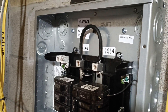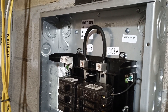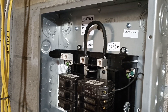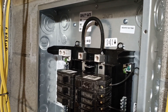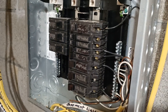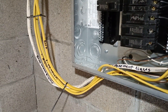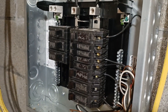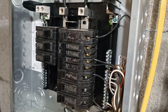This would not be a safe thing to do if you are connected to grid power, or if you ever want to use any double pole breakers — double pole breakers would require 220 volts, and having that jumper across there with 220 would not be a good thing. If you are using an inverter that produces 220 volts, you'd have a double pole breaker at the bottom powering both sides of the box, which means you wouldn't need that jumper. All of my circuits are coming down through the floor and are connected to various single pole breakers, going off and powering their respective loads.